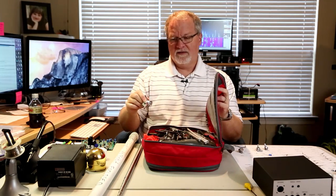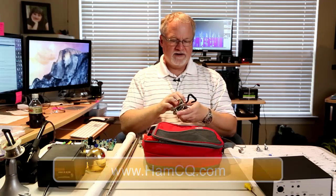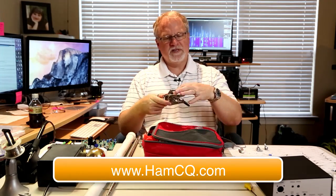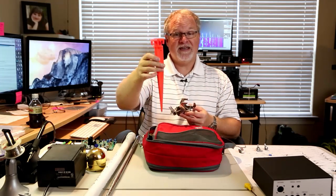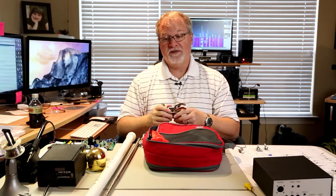If I want to deploy this some other way than just a solid surface like concrete or asphalt, I've got this clamp. This clamp is from High Sierra — I'll put a link to this too. It's a Jaws clamp that opens a couple of inches on one side. You can clamp it to a picnic table, clamp it to a balcony railing, clamp it to a stake that you've driven in the ground, whether that's in the dirt or in the hard sand. The other side of this Jaws clamp is a three-eighths by 24 connector with SO239. You can use a five millimeter hex key to loosen this up and rotate it 90 degrees so that you can make it clamp to something one way but have the antenna going 90 degrees the other way. So that's how I get the radiating element to stand up on any surface.